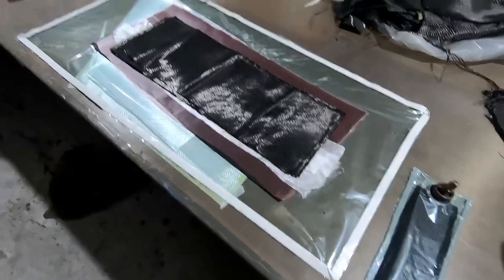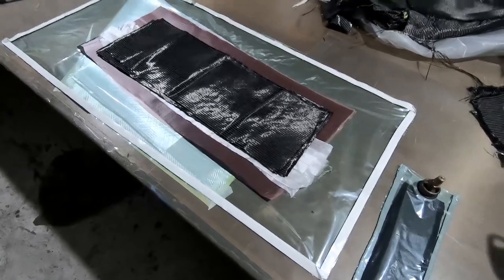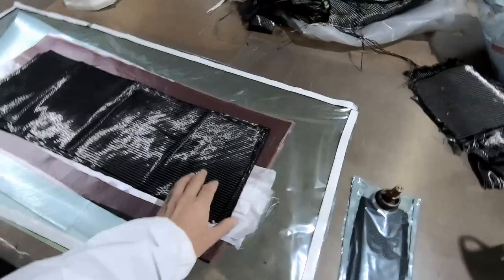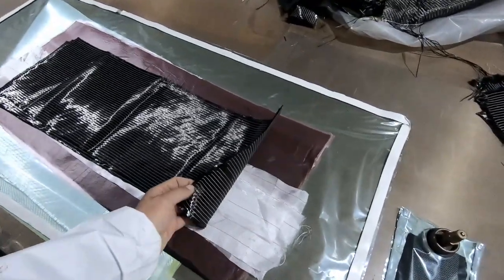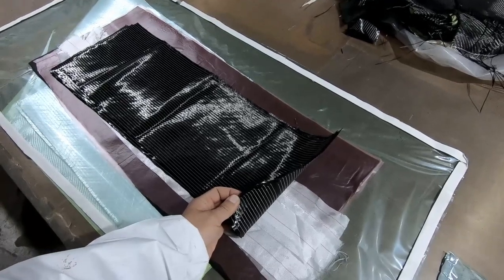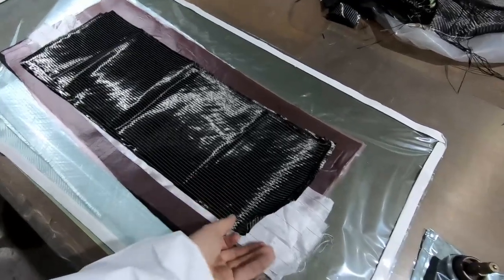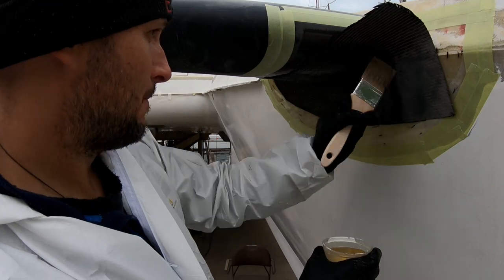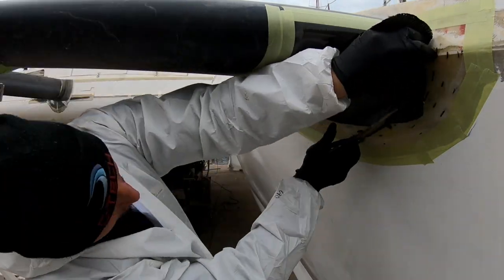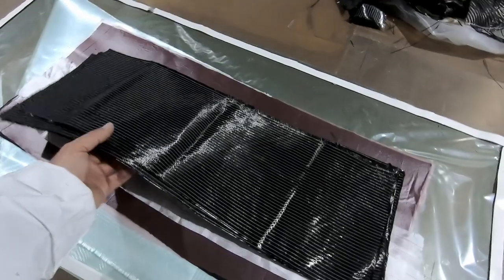I'm going to go through the vacuum bagging consumable stack. The first things that'll go down are the carbon double bias, and that will be holding our main beam to our hull. That's the first thing that will get laminated in with resin, sticky stuff cut to the right shape, overlaps, tapers, and all that sort of thing done first.